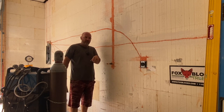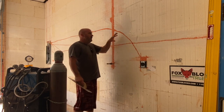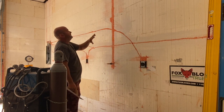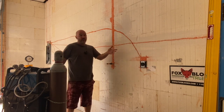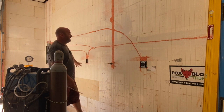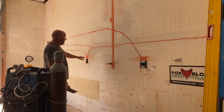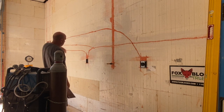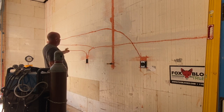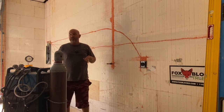I'm kind of excited to move all my metal stuff, my welding stuff to this garage so it's not in my wood shop where I always worry about a fire. You can kind of see how clean it is. Probably eight or nine minutes to rasp this whole wall off. This side here is completely ready for drywall. The reason I've got these multiple lines running is because I'm probably going to have a cold plunge and some other stuff in here that needs dedicated lines, maybe a fridge. So I have a dedicated receptacle — that's why they look like they're kind of spidering down, but it's one run. Then this run daisy chains around the rest of my shop for my GFCIs.